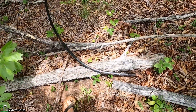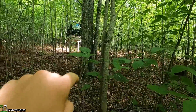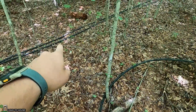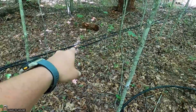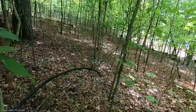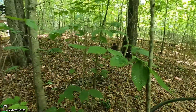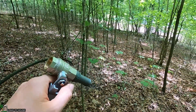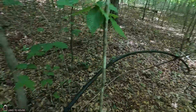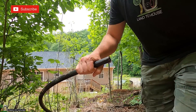So I think what I'm going to do is drag the other end a little bit further down and hook it up. Instead of being right at the tank, I'll hook it up into the previous line down the hill a little bit. Instead of taking the poly pipe up the hill and attaching to the tank, I've simply just skirted over here where I can connect to this pipe right here, which is the same delivery pipe coming down the hill. It'll give us the same amount of pressure because it still has the same amount of water coming into the pipe. I only gained a couple of feet by doing that, but I think it's going to work out well in the end.